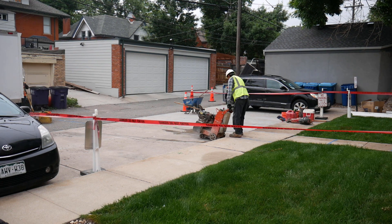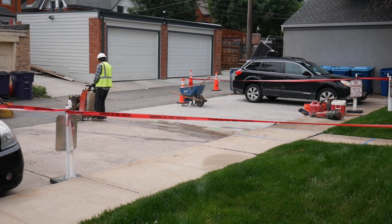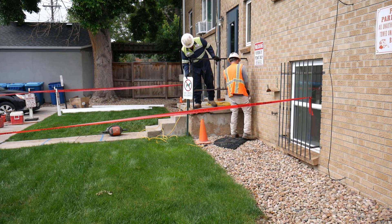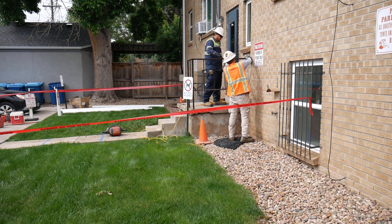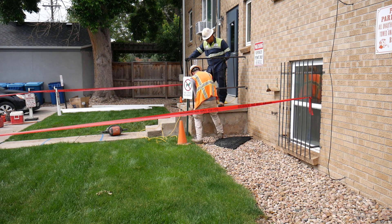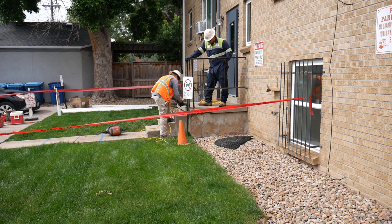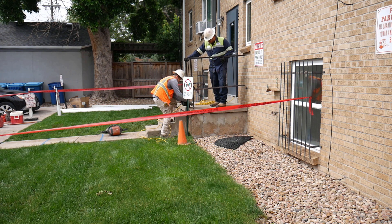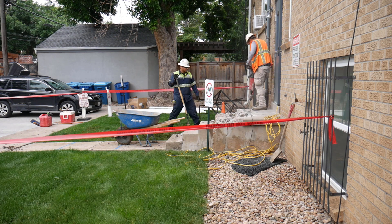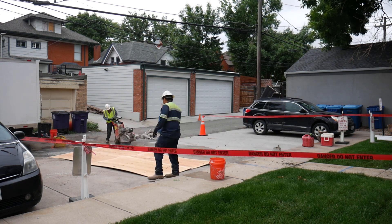We're going to cut a three-foot wide trench all the way down to the city tap and all the way back up, basically removing that entire section of concrete to the back stairs and demolishing all of the stairs as well. A lot of flat work repair because we can't do trenchless system repairs in the city of Denver. We start by getting rid of all the railing — I've got to replace that with some brand new welding and nice railings to make sure everything's to code. Then we're going to go ahead and demolish those back stairs and the landing. It's unfortunate that we can't sleeve this, but even with pipe bursting we would have had to take the back stairs out. There must have been a modification on this building way, way back when.